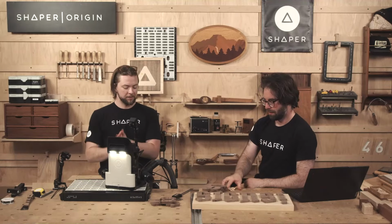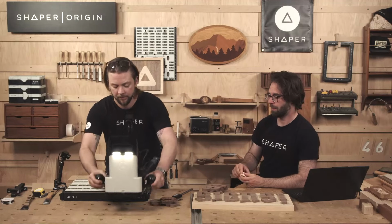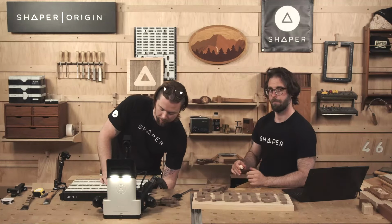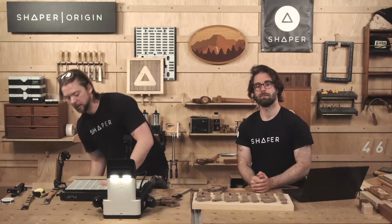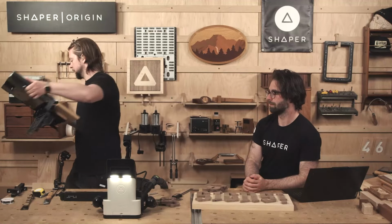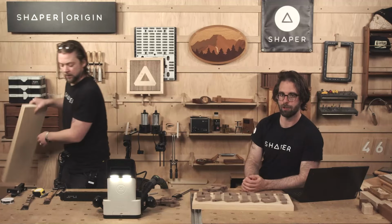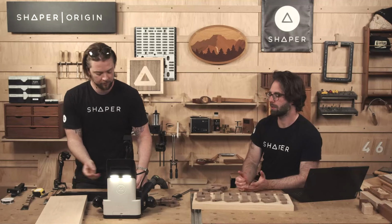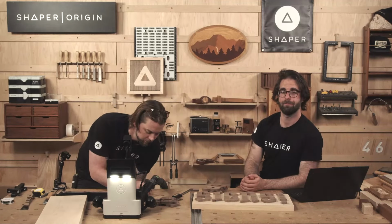Cool. All right, so we have all the letters now. We do still need that background. And I think we're going to set up a tape board for this, right, Jake? Yeah, for this kind of thing, because it's quite a bit wider than the workstation. It's easier just to mill up 2 boards at the same thickness. And we're not even going all the way through this. We're just going, again, 0.4 inches deep on all of these helixed holes. So we don't even need a spoil board underneath. We're just going to set 2 pieces up right on the MFT here, and we'll be all set.